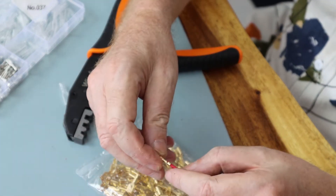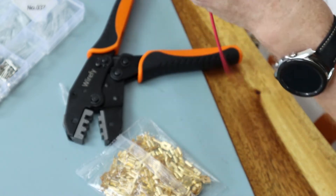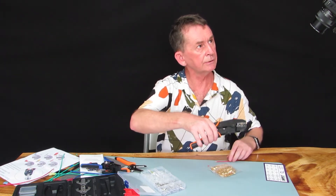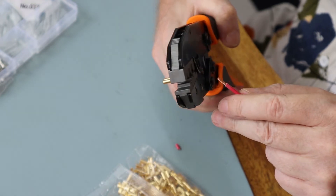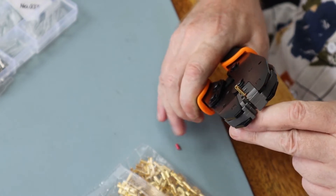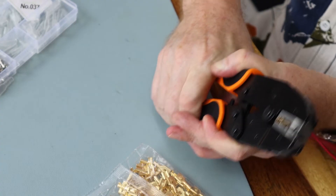What happened was I pushed the wire in too far, and what happened was I squeezed the thing around the plastic. So you have to be a little bit more careful with open ones. Try and hold the crimp like this, and when you're putting the wire in from the far side, make sure the wire doesn't go in too far, because you will end up crimping the insulation of the wire in the wrong part.